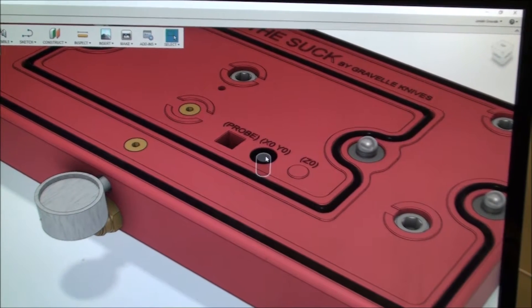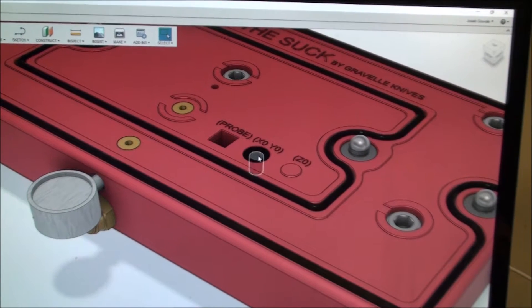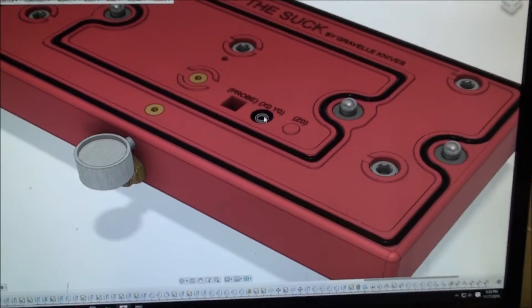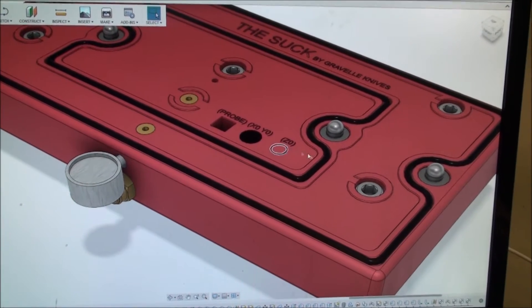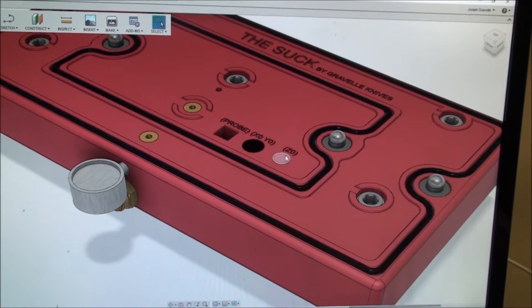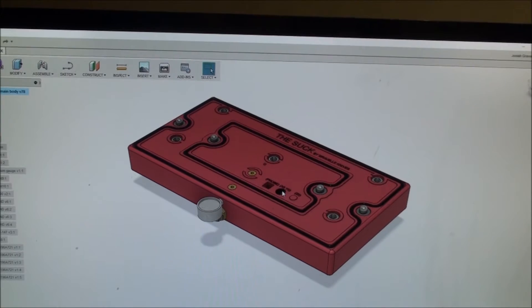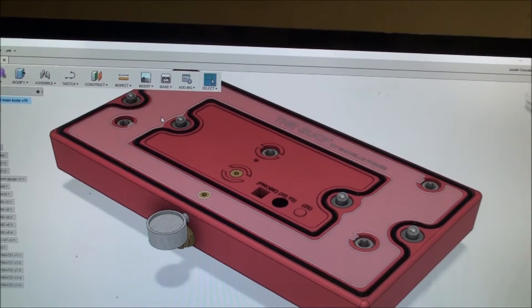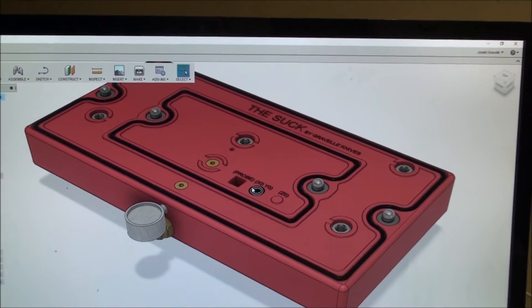Right here is actually a sleeve that's going to be more round than a circle that the Tormach could mill. So with this perfectly round hardened steel sleeve, you can in the future, putting a pallet on top of it, set the origin to the center of this and it will be more accurate in theory. I set a specific place here to do a Z-touch off so that pallets I use in the future will be consistent. Theoretically, at the beginning of the day, I could set my origin to this one place and then continually change out pallets all day and never have to reset a zero point. All the pallets would be set to the same origin, which would save some time down the road.